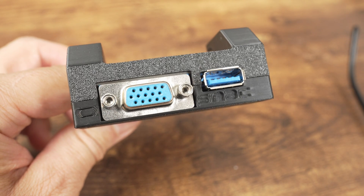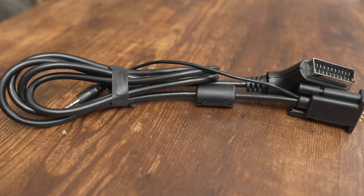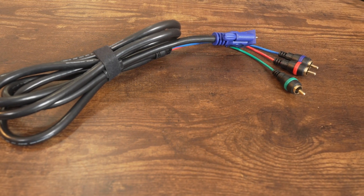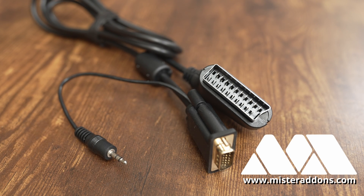There is the VGA port that will output the Analog Pocket's video to a CRT. You will need a VGA to SCART adapter or a VGA to component adapter to accomplish this. I'd like to thank Mr. Addons for sending me the VGA to SCART cable so I can test RGB. Note that I have an older revision of the Analogizer that only supports RGB, but the ones available now also support component video. The older revisions will also support composite and S-Video through Mike Simone's YC adapter design.